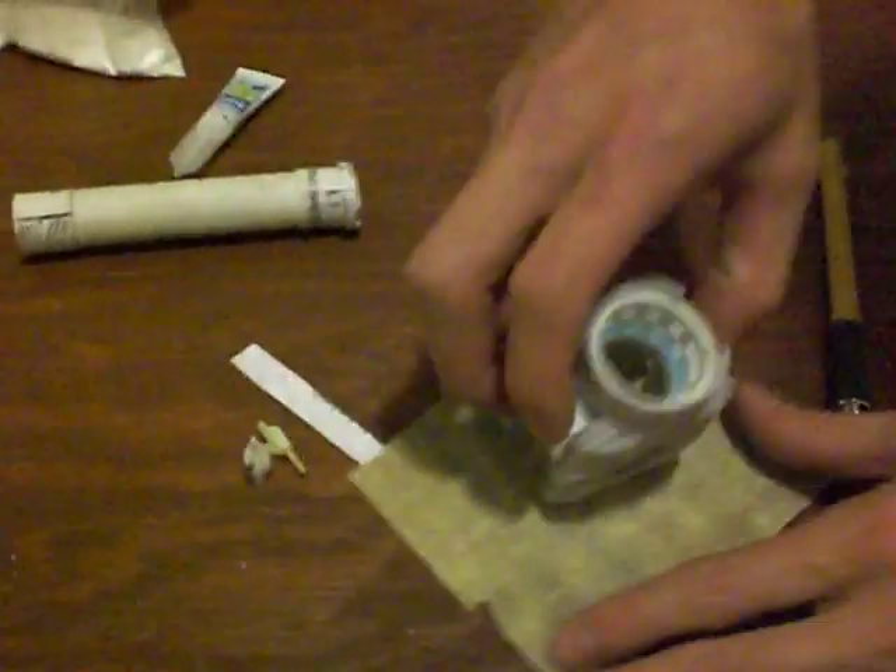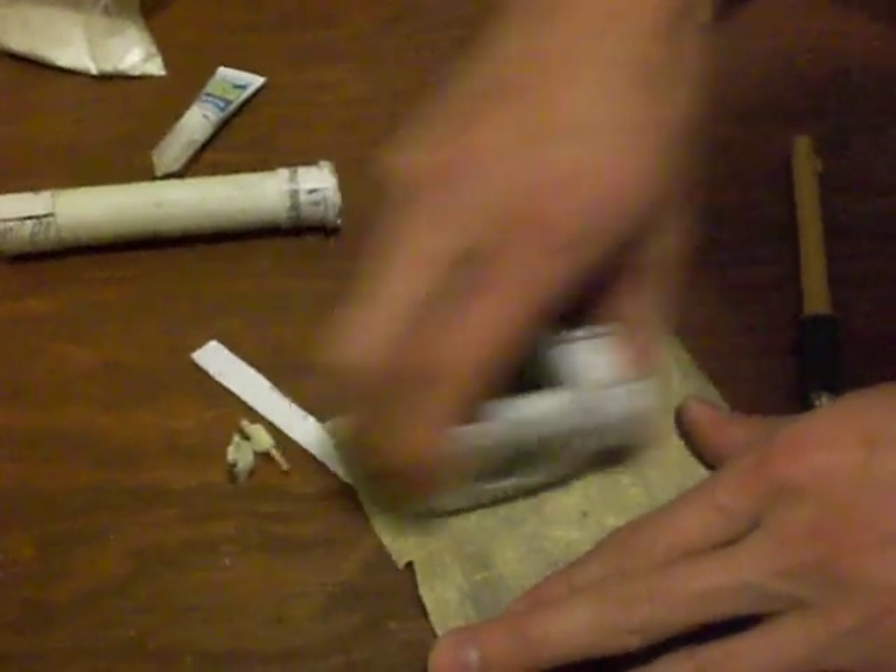You can lay out some sort of paper with a little bit of paint on it, run the part against it to see where the high points are, and just keep sanding until you get an even surface. You can do that with pretty much any part you want to smooth. As I finish the layers on the barrel, I'll go back with sandpaper backed by a flat surface to sand the entire thing smooth so it'll be flush without little wrinkles and bumps — that makes the finished product look nicer.